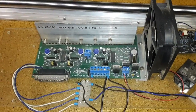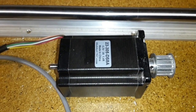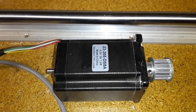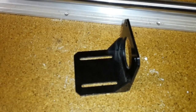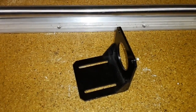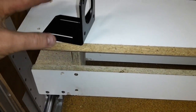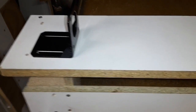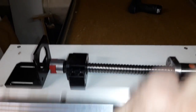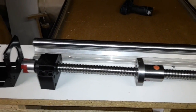I'm going to use a hobby CNC controller with NEMA 23 stepper motors — again, these were used on a different project. I'll be using these stepper motor mounts and they'll just be placed on here with my ball screw and then the linear slide on top.